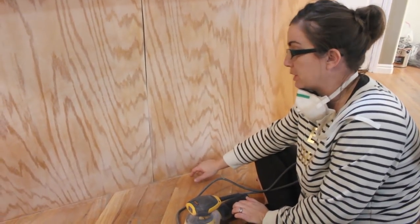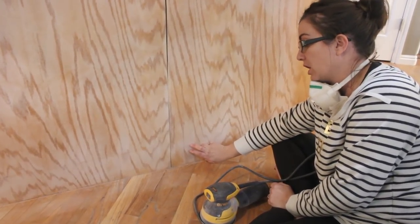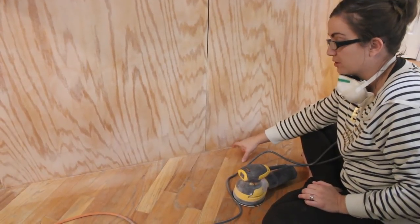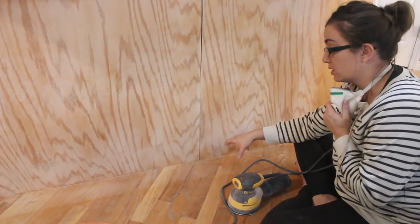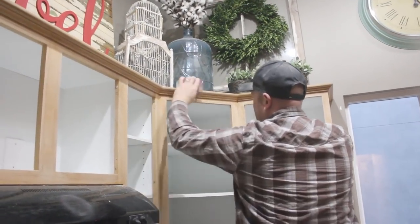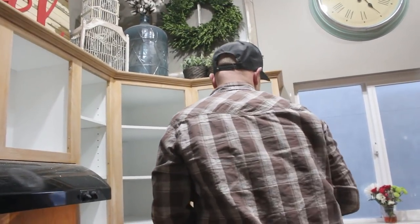I'm not being super careful about the floors because we're going to be refinishing them anyway. But if you are not refinishing your floors, I would only sand to about there because you're going to be putting molding on here. If you weren't going to put molding, I would hand sand down here so you don't gouge your floors. We're actually going to sand all these cabinets and then come back through and sand about three inches out completely down to the raw wood, because we're refinishing the floors next week. Zeb is hand-sanding the trim and anywhere near an appliance because we don't want to risk scratching it.